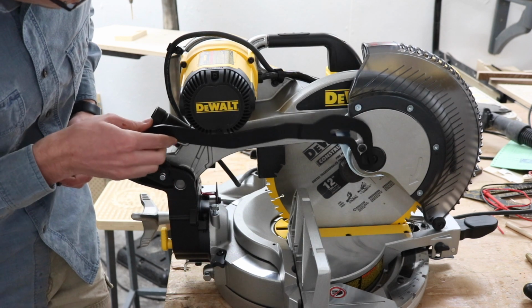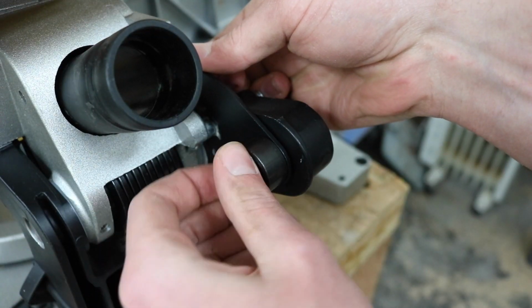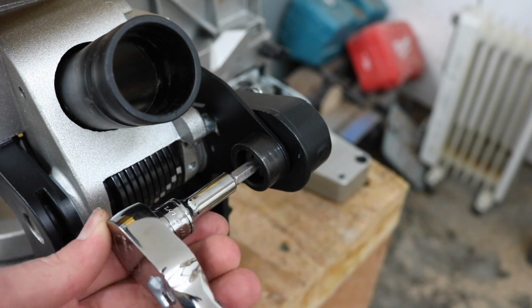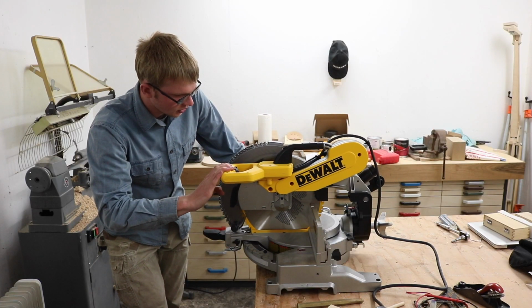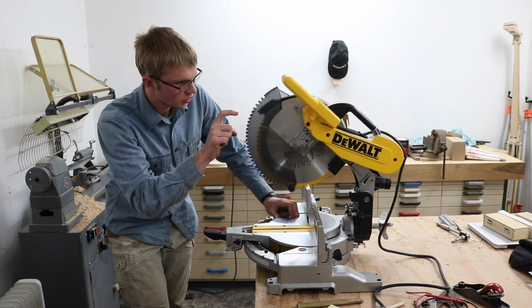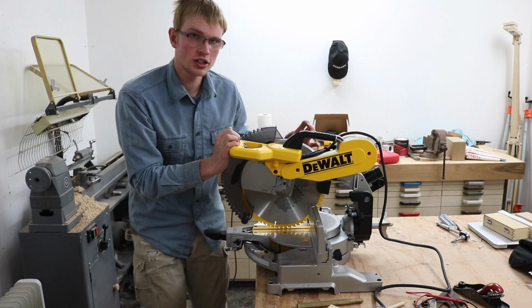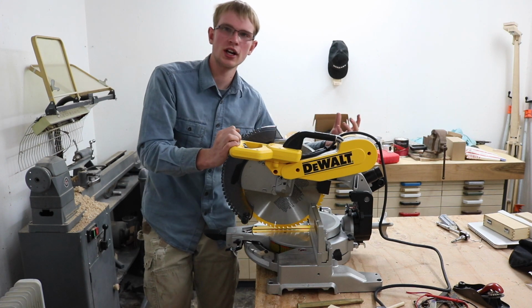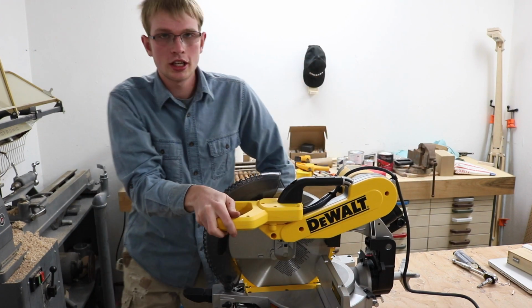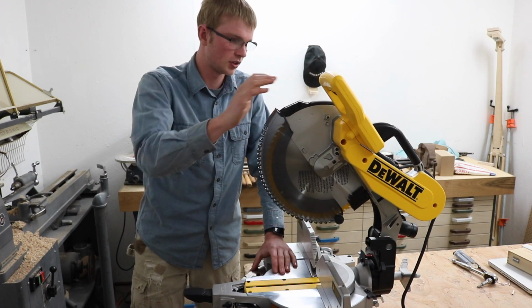And this thing that operates the guard, it's also held on by the stop pin, which, as you recall, I removed earlier. So this fits tight enough that it doesn't lift nearly as fast as it did before. It's very gentle. And yet I think it's not so tight that it's going to be putting undue stress on the parts. Now obviously this just removes the play. So with some side-to-side force, if you really yank on it, you can get it to flex a little bit. To me, this isn't nearly the problem that it was originally.